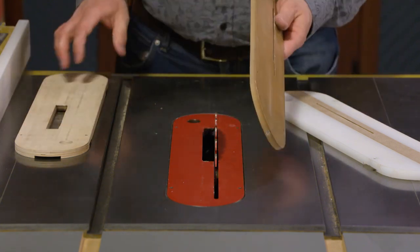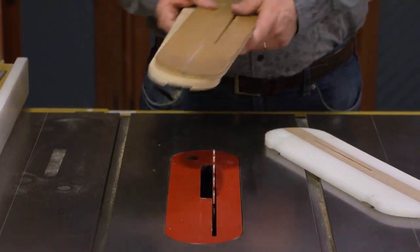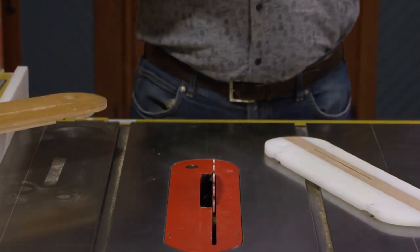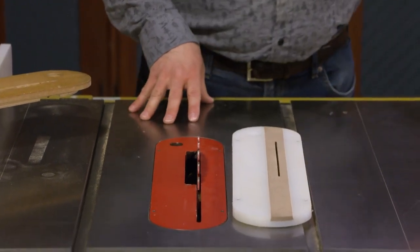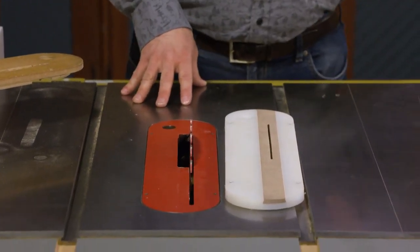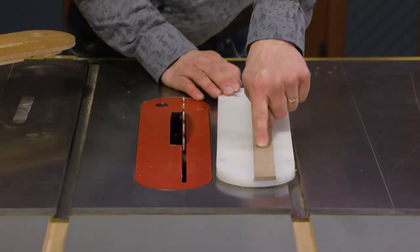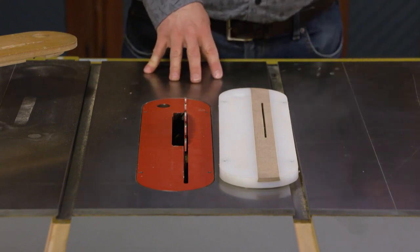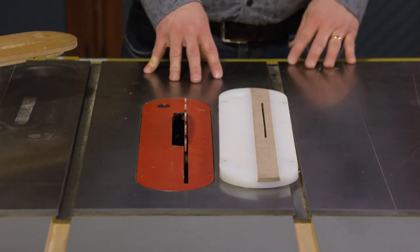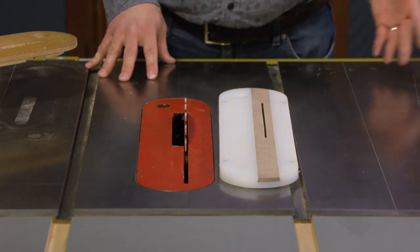In the past, we've shown how to make your own from MDF or even some Baltic birch plywood. They're great options, but the project I want to go through today is to make one zero clearance insert, and then you only replace the section of the insert where it gets chewed up — and that's this hardboard strip down the middle. We're going to use an unusual material, but I'll show you how to make it, and you can get this done in probably an hour or two. It's a great way to improve the performance of your table saw.